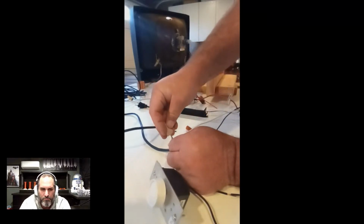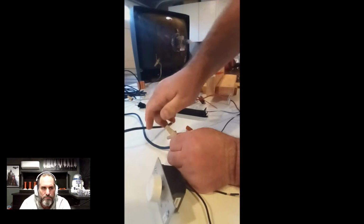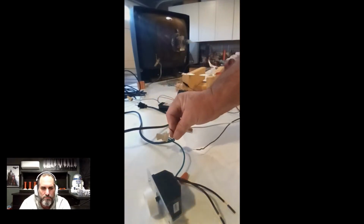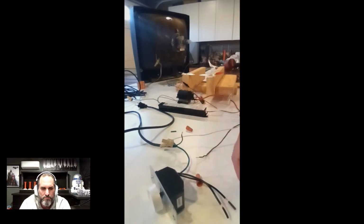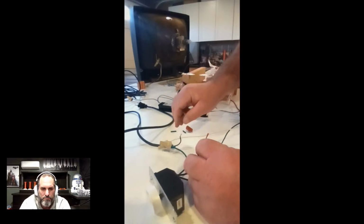Line those two up. Wire nut those together. Now, last one left is our black wire. We've got two coming out of here, okay? And this one goes to our ballast, okay? So what we're gonna do is hook one into one and one into the other, okay?